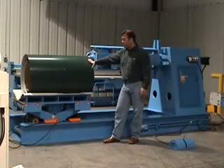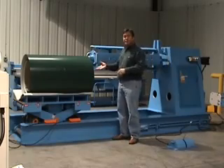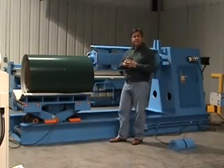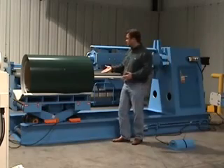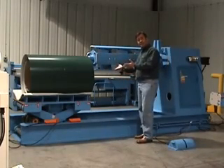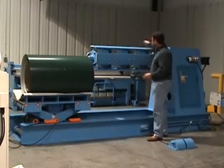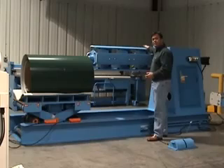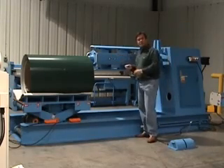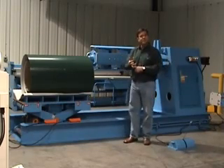The advantages of a coil cart are twofold. One is you won't ever cone your material on your coil. A lot of times without a coil cart, your operator will be lifting up on the outside of the coil, damaging it. Two is he'll be pulling off and think he's off the top side of the mandrel, but as he's pulling, he pulls the inner core out. So the advantages are very fast changeover, and two is you won't damage your coils.